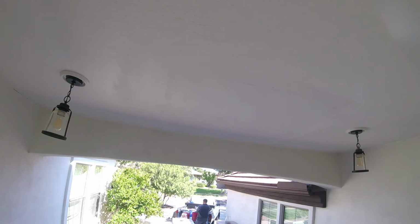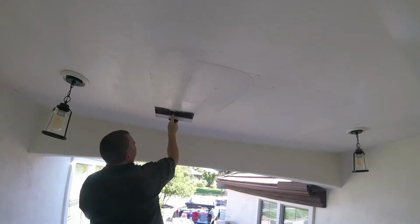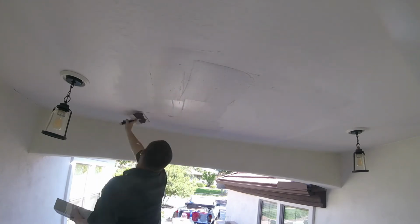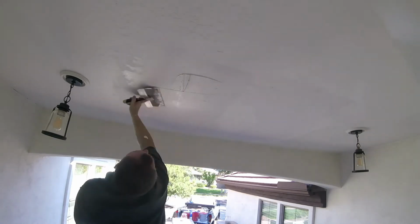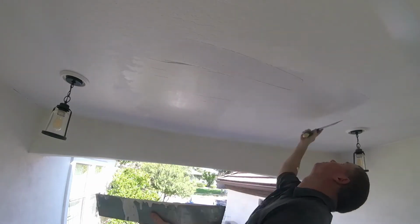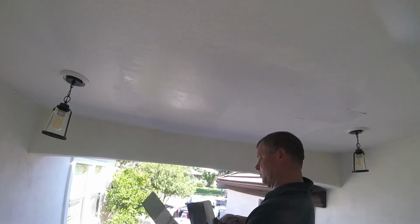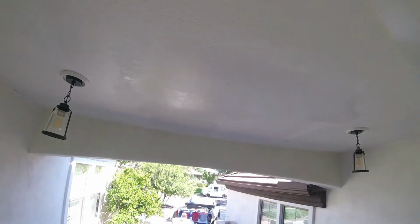If you're not using joint compounds, maybe you just want to do a first coat with a hot mud, that's fine, and do a second coat with the joint compound, let it dry overnight. You can do that process too. Here I'm just doing a second coat with another layer of 5-minute mud. I'm just going past my first coat mud. Just a nice tight skim. I'm not trying to put a big old hump on the ceiling. The first coat I already filled it in. The second coat's just basically another fill-in. I go past my first coat, always go past your original coat with your next coat.